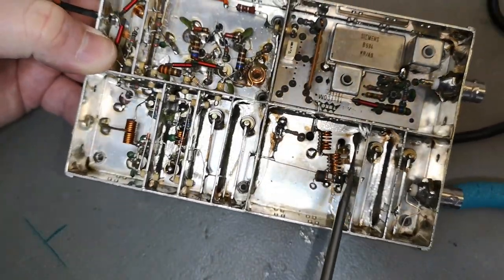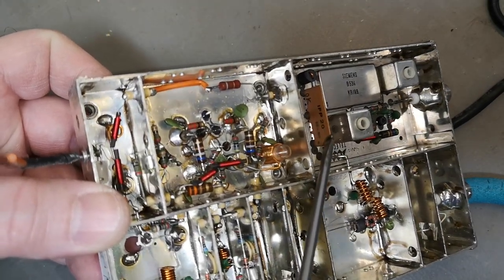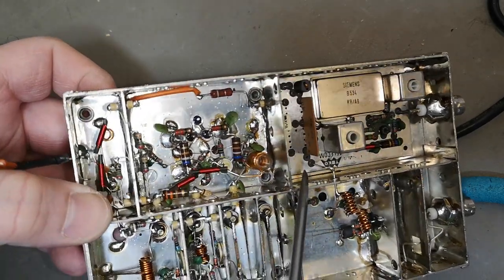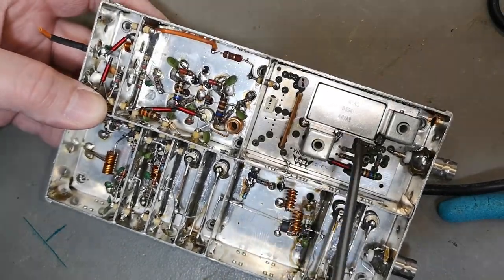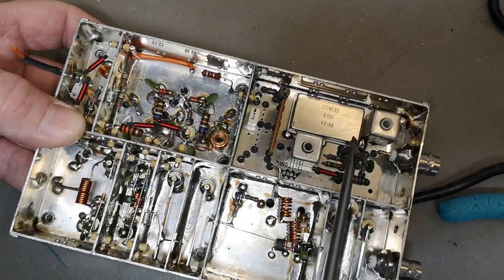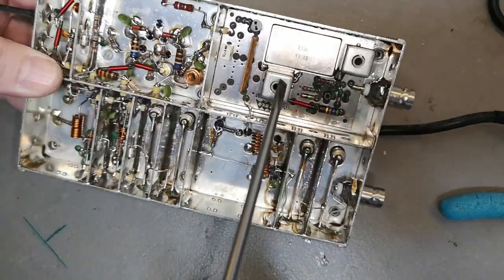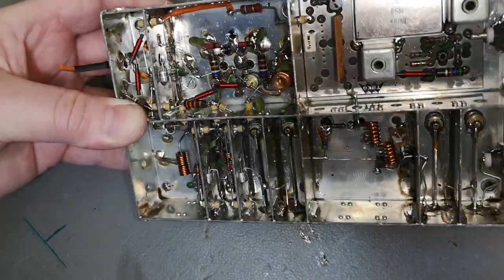The IF goes out here, and here is an IFP-20 — that means 20 dB gain in the frequency range 18 to 90 MHz. You just plug in one of these gain blocks and you're good to go. Then the IF goes through this filter — probably a crystal or resonance filter — which is your channel filter. You always see really nice, sexy filters like this in a channelizer, with correct input impedance matching, and a little output amplifier. That's what there is to say about the channelizer section.